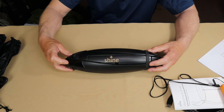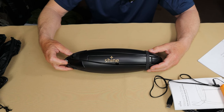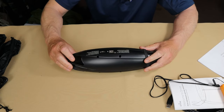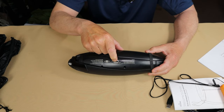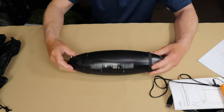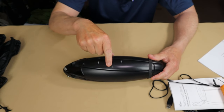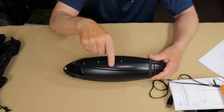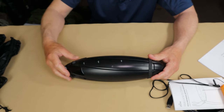It does have a number of important features such as MPPT — maximum power point tracking — as well as over-voltage and under-voltage protection. It has two ports: a micro USB charging input and a standard USB Type-A output port. It has an LED indicator that's used for checking battery status, wind speed in terms of whether it's running fast enough to charge the internal battery, and temperature — all communicated through different colors and sequences of flashes, which are well detailed in the manual.